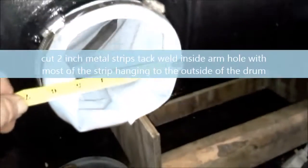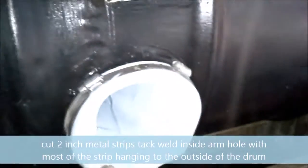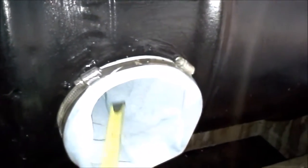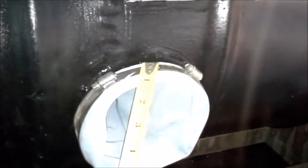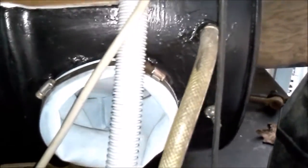And these, let's see, these were pretty tight. And I made the holes at 6 inches, and the gloves were pretty tight to fit on here. And then I just took big hose clamps. Once I had the gloves in, I just rolled them over the edge, hose clamped them in, pretty much done. So 6 inch, I wouldn't really go any bigger than 6 inch on those.